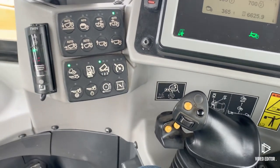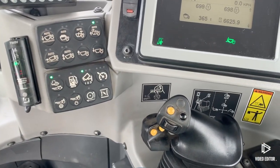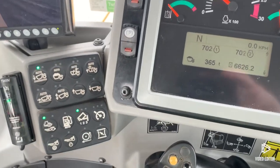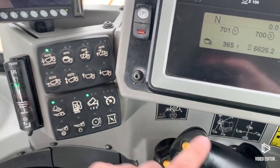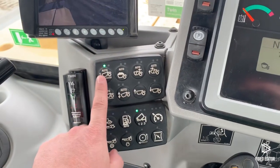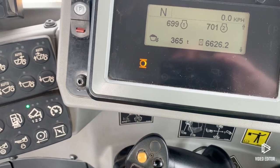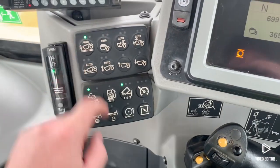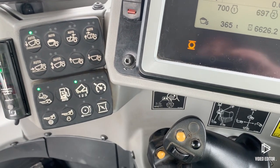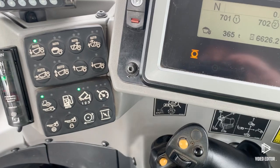It's just a nice little feature to preset some of those settings on your bowl and on your cushion ride so that you don't have to manually do it all every time you go into your cut. One thing I missed when going over the presets — you can also set your transmission lock with those presets. For example, when you're going into that cut, you can preset your transmission to be locked in second gear. You can have your transmission lock set to the sequence assist as well, so that when it hits second gear you can click your sequence assist and it'll hold your transmission for you.